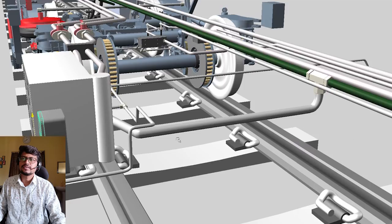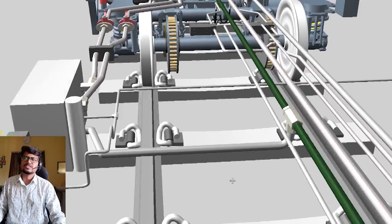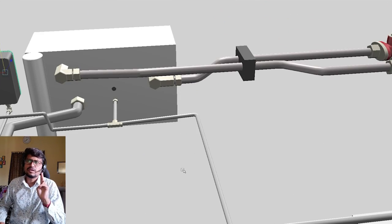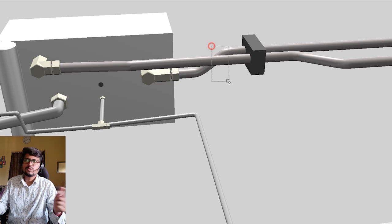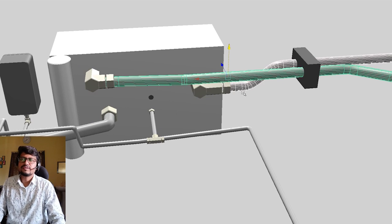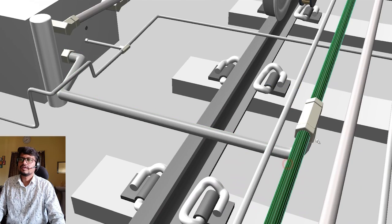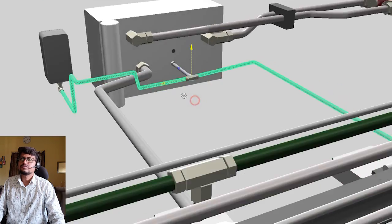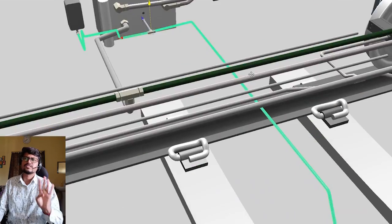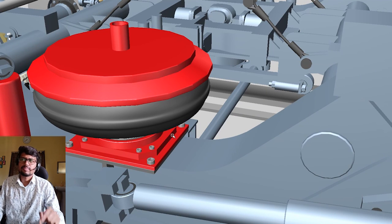The FIBA has four connections. Connection one and two are coming from both sides of the suspension system. The third connection is coming from the BP (brake pipe). The fourth connection is for the indication. You can see the indicators — both side indicator pipes. So these are the four connections.